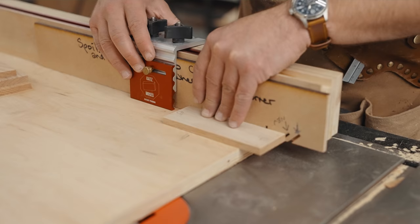Here's the important part about tray dividers: you need to ensure that your pieces are facing each other and may not be dead center. When you cut the dado for your dividers, make sure the tops are facing each other. You need to do one with the top facing the blade and one with the top facing away — that'll ensure that no matter where you put your divider, it's going to be in the exact same spot. Use a stop block on your sled and you can just cut all the way through.